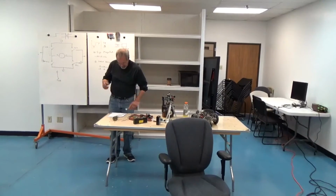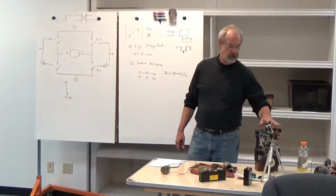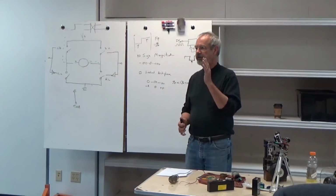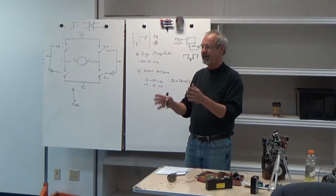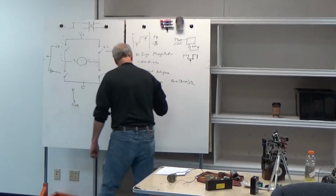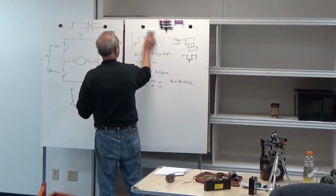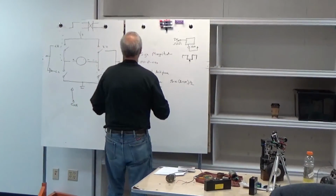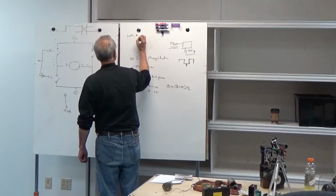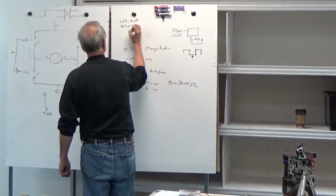There's one last little piece which is useful when you're actually controlling a two-wheel robot like this, where you have two H-bridges, two motors, and two wheels, and you normally control the thing in terms of a left and a right velocity, but that's actually pretty clumsy when you're trying to write high-level software. So the last point is that we define two values up here, which we're going to call, rather than currently we have left and right, instead we're going to have velocity and rotation.